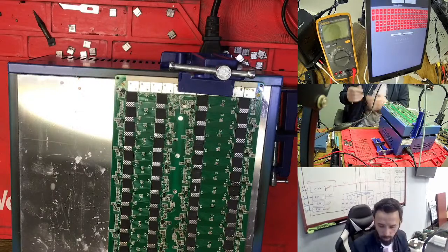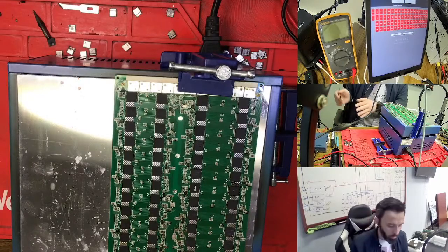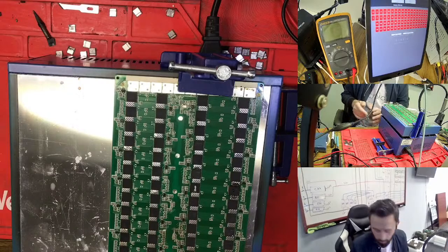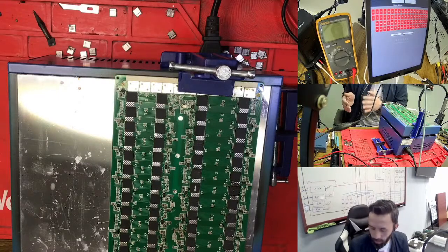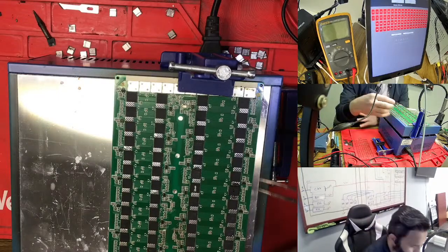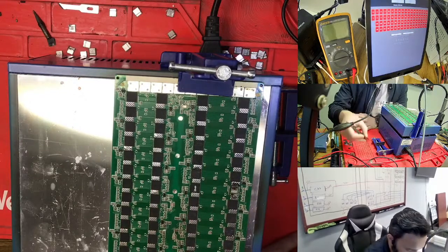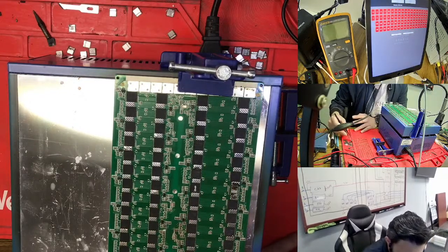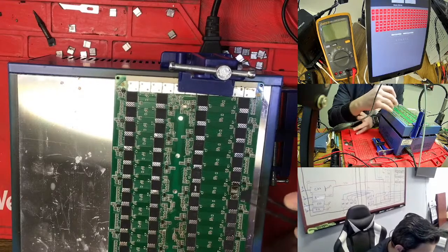If you go with one hashboard, you take out this chip, then you put it aside, then you heat again, turning the template on and off, this is not good. You take too much of your time, and you lose your time, nothing more. And so right now this one is ready, you see it's taken out, because the template is good right now and heating a lot, so we can quickly change the chip. We need to add this one.